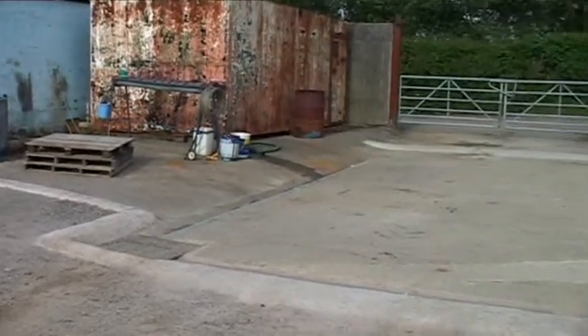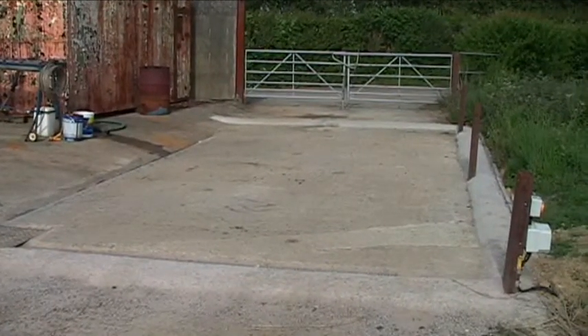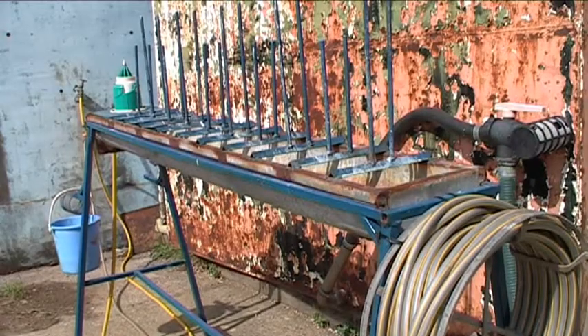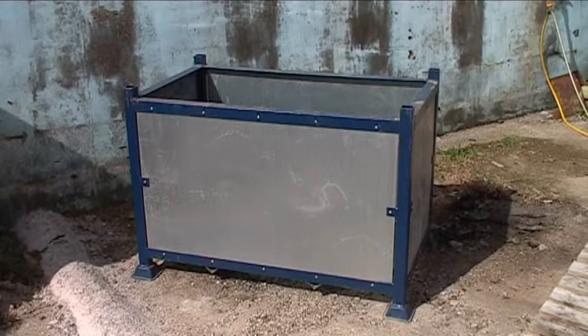So let's go and see how Tim has set up his system. This is the bunded area that you used to fill in — just run us through your process please. The sprayer would normally be parked up over there inside the bund. We'll connect the water and the pallet of chemicals will come here from our suppliers. We then fill the sprayer and the cans when they're empty will go onto the drip trays. All the liquid collected from the drip trays goes into the biobed. We can wash them down there as well and that also goes into the biobed. When they've been rinsed they'll go into the stillage behind me, which has a mesh floor, and all the liquid that comes out of the cans gets collected in the collection area here and goes through the biobed as well.